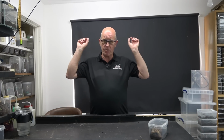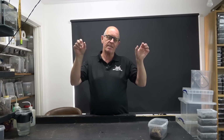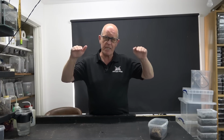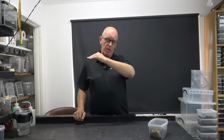The side clips, where the fascias and the boards actually connect the rubber to the roof, create a little gully, so the water drains down to the back of the building. So we just need to put guttering along the back. We won't need it anywhere else. It just needs to be along the back edge.